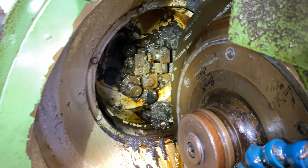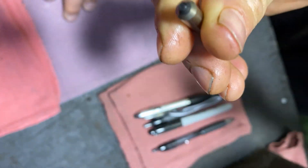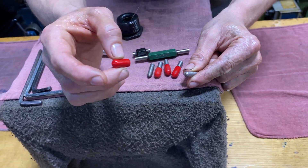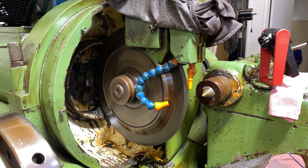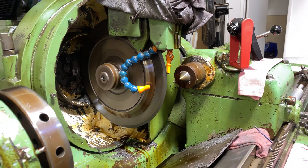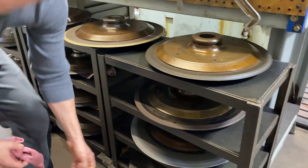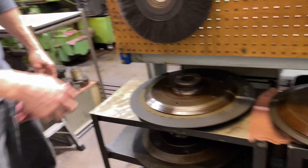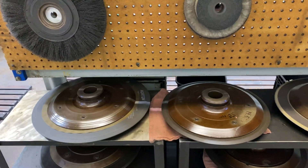A couple of areas you probably wouldn't want to stick your finger in there. There's some grinding gunk in there, but basically that's where the diamonds are. These little diamond nibs are placed in the back on that jig that's adjusted from the back. Luke is adjusting that very back one now. Obviously we don't do this with the wheel on, but this allows the machine's automatic cycle to run this large vitrified wheel in and out and dress that tip edge. There's their inventory of all the different wheels — most are already set at 30 degrees for 60-degree threads, 14.5 degrees, and more of the common ones.